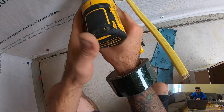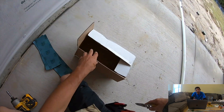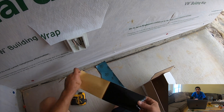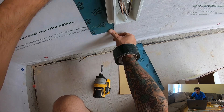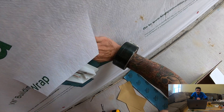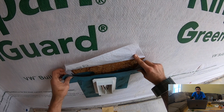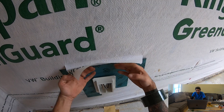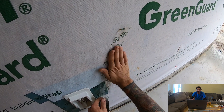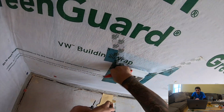Before we go anywhere with the tape we're going to make sure we get this receptacle done — make sure you're not hitting the wire with the screws. Cut in the receptacle and then we're going to start taping the sides first: one side, then the other side, and then you want to make sure that top piece reaches to the end of both pieces of tape. The idea is that if water ever gets down the wall behind the siding, you want it funneled so it comes out right in the middle.